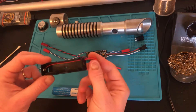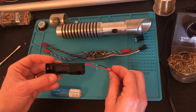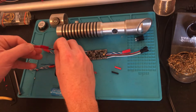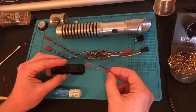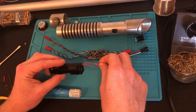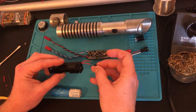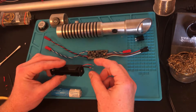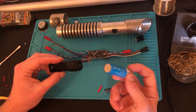I have this holder here with two wires sticking out of it — the battery fits in here nicely. I've cut out this connector which we're going to splice together to this; it's the opposite to my battery connector so these will plug in together. We're going to pre-tin these wires so there's plenty of solder on there, then connect them together. But before we do that, we're going to install shrink wrap because we need to protect the wires after soldering — if left exposed they can touch, short out the battery, and cause it to overheat or explode.